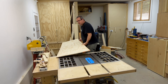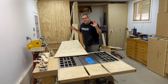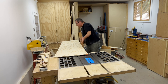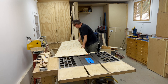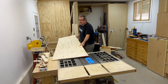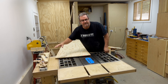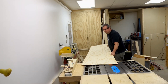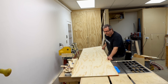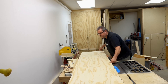I'm ready to start my cut now. I'll pull my sheet back, check my fence again — make sure it's tight, and it is. Before I start the saw, I'm going to show you how I'm going to hold the sheet. I'm not going to try to reach the other side — I'm going to hold it from this side, hold this end up, and use this hand to push it down. When I'm pushing it through, I'm going to be watching the fence, not the blade — watching how tight the stock is against the fence and making sure it doesn't move away. You also want to make sure you're always in control of the workpiece. Never let go as you're pushing it through. Although the risk of kickback is lower with a larger sheet like this, it's still a risk you shouldn't be willing to take.